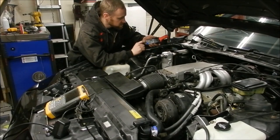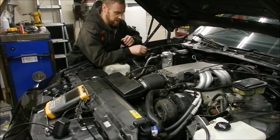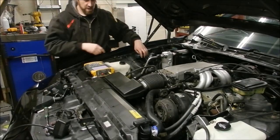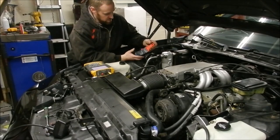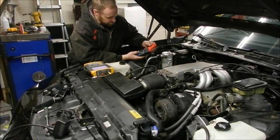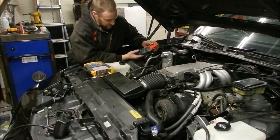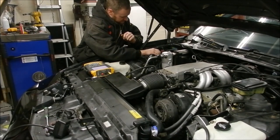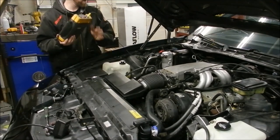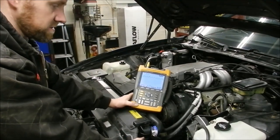It is cheaper, so what do you expect. We have it on one millivolt per 100 milliamps. I set the scope to the correct setting for one millivolt per 100 milliamps — it is a little bit different on the Fluke so you just do the math and figure it out. There is a zero button on here — I am going to hit and hold that, then let go. It zeroes out to 0.01 right now. Now I take this clamp and throw it on. I changed my scale and got it set for the seconds I want — I have not changed the voltage yet.